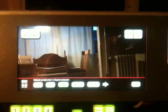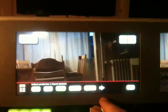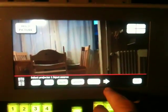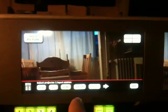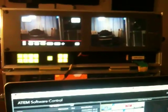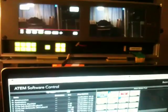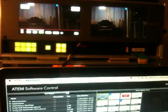This is really a great example of how modded Blackmagic Design products are used to create a very unique media control interface for input sources in an AV installation. We have a Smart View Duo modded with a touchscreen, we have an Arduino Ethernet board controlling a Blackmagic switcher, and we have a Blackmagic Video Hub Micro also connected to the Arduino. The Arduino essentially creates a link between the Blackmagic switcher and the Blackmagic Micro Video Hub.